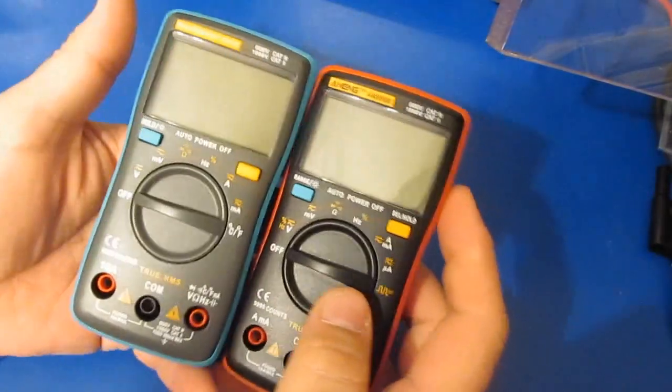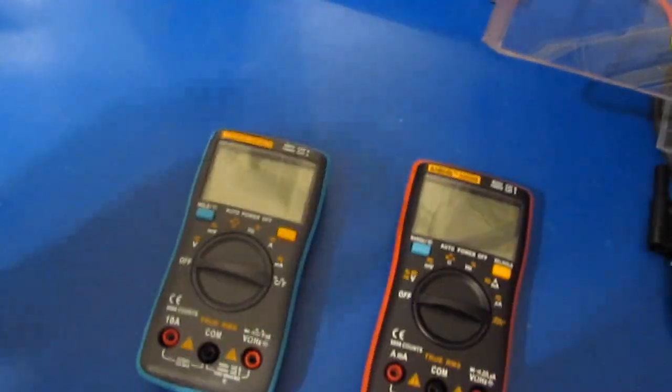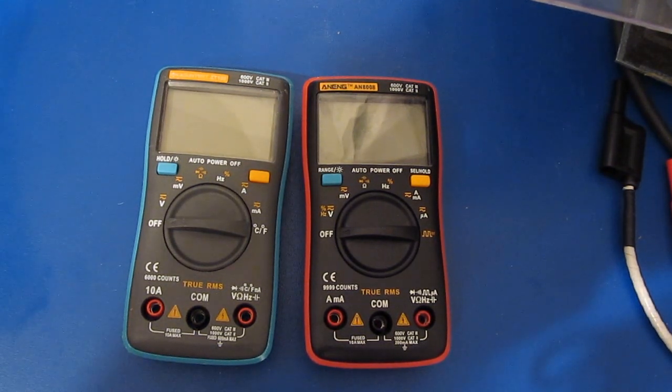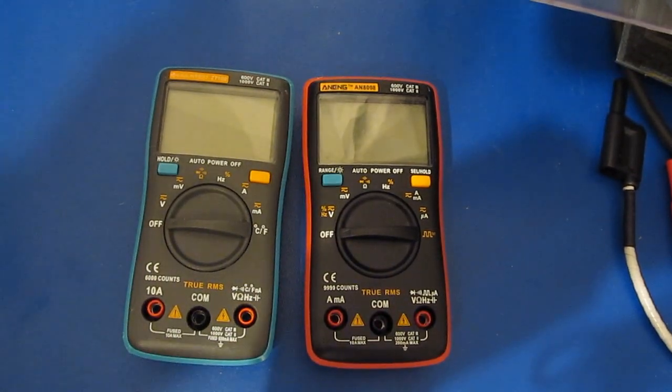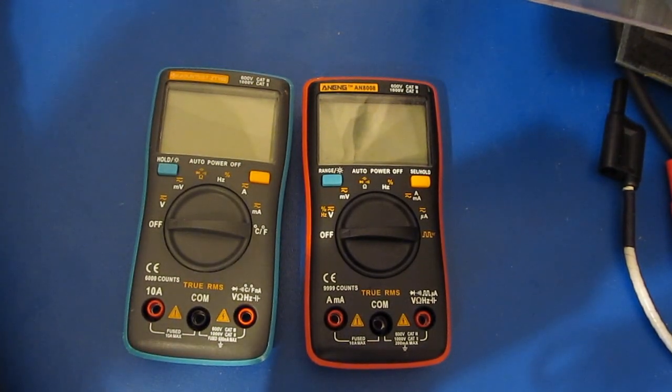I think our next step is to come up with some kind of a drop test form. If you look in IEC 61010 section 8.3.2, they talk about drop testing handheld devices, so I'm assuming that applies to handheld meters. They call to have them dropped one time from one meter onto a piece of 50 millimeter thick hardwood, and then the hardwood should be placed onto concrete.